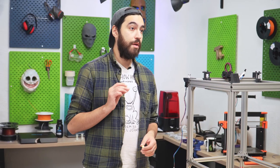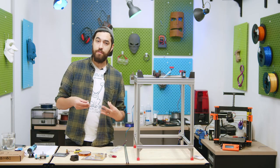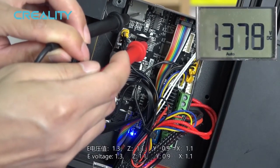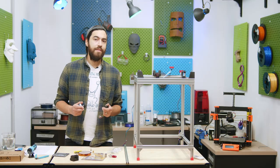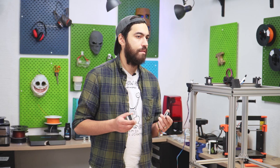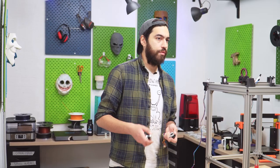What is a gear ratio? In lots of extruders there's one small gear that turns a much larger gear — the larger gear turns a lot slower than the smaller gear but its torque is increased while the speed is decreased. Torque is sort of like force but the circular motion version of force. You obviously need some force to move the filament, but too much torque is not always a good thing. For instance if you upgrade your Ender 3 to have a Bondtech BMG extruder you actually have to decrease the current going to the motor by around 40% because there is too much torque and it would push the PTFE tube out of the extruder. An Ender 3 extruder motor has around 40 newton-centimeters of torque but the NEMA 14 has around 8 to 10.